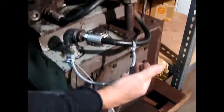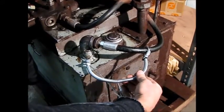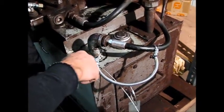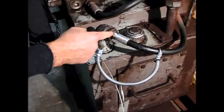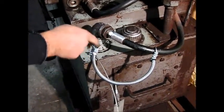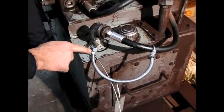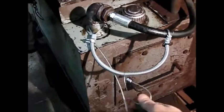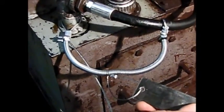Again, for the steps on this, we looped the cable through itself here. We installed the spring. We installed the aluminum ferrule here. We wrapped the cable around the anchor portion twice. If you wanted to go around a fitting like this, as long as you're behind this lip, that's fine. Wrap your cable twice, come back through your ferrule, install your cable clamp. That's all there is to it. You have a tagged and certified restraint that will do the job.